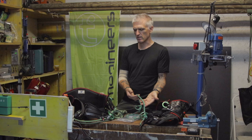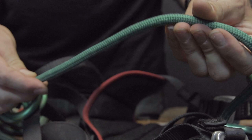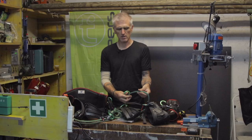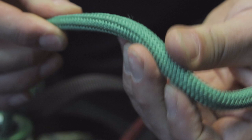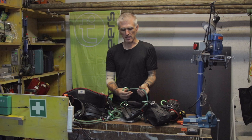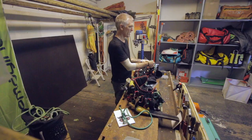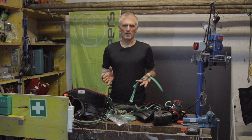The other thing you can do is contrast and compare. On this harness, you can see there is an aluminium deposit from the ring running on the bridge — this grey deposit — and the other side is as new. Of course it's not new because it has seen service life and flexing. But it does allow you to compare the two sides and get a feel for whether there has been abrasion. This is a normal wear pattern and is no cause for alarm — it's what happens when you get hardware running on textiles.